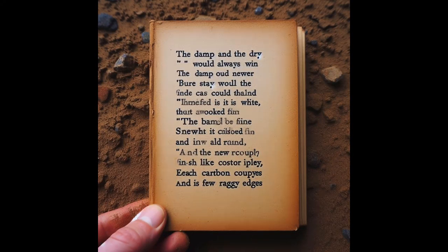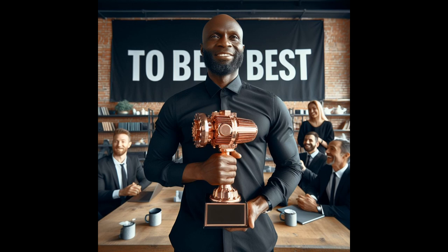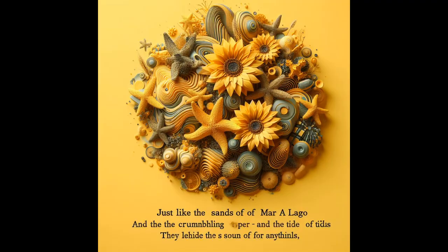By subjecting the aluminum precipitate to high temperatures in a controlled environment, the compounds can be thermally decomposed, leading to the formation of metallic aluminum. However, the efficiency and success of this process would depend on various factors such as the composition of the precipitation, the purity of the aluminum compounds present, and the specific conditions used during the melting and reduction process. It is important to exercise caution and ensure proper safety measures when attempting to melt aluminum precipitation, as high temperatures are involved in the process. Additionally, the resulting metallic aluminum may still require further purification steps to achieve the desired level of purity for specific applications.